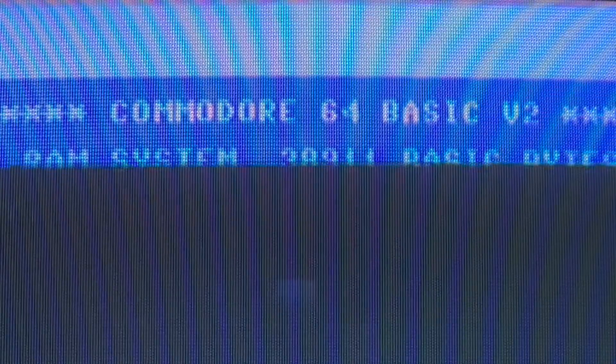The image was a little bit blurry — not as sharp as the black and white PAL signal would be from the C64 directly to the monitor. So I wanted to find a better way to get a sharper, more detailed picture without going through HDMI. I had the idea that it would probably be better to try and convert to RGB SCART first.